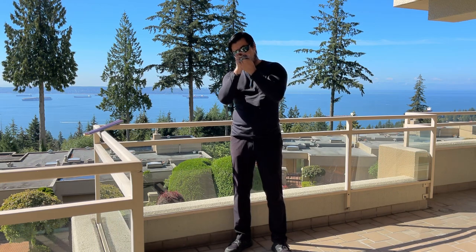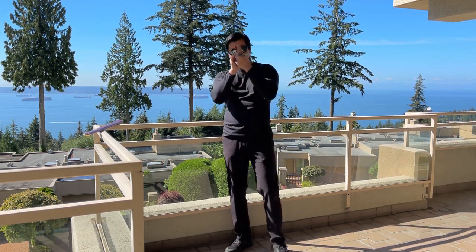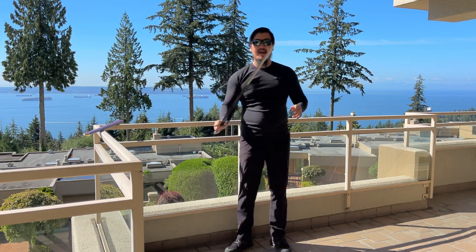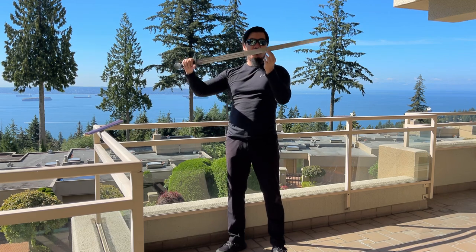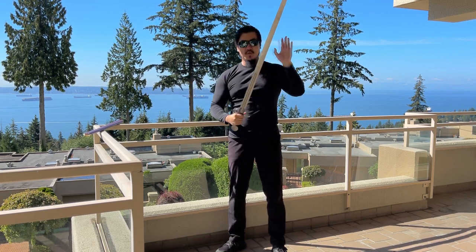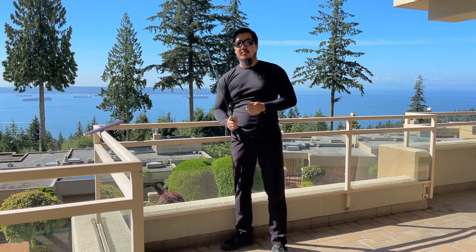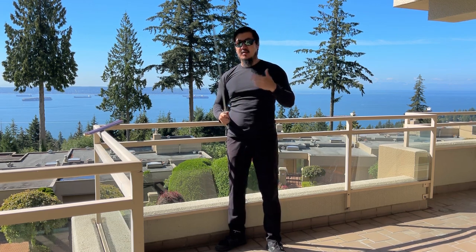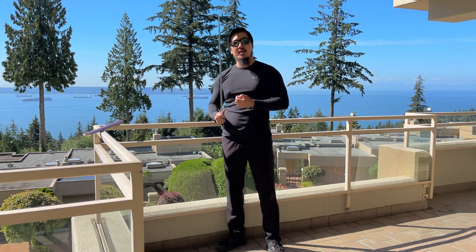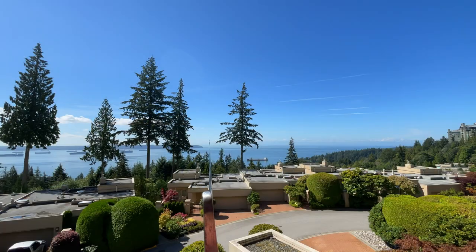The blade is completely flat and symmetrical, executes the unique cross-section perfectly, has a strong handmade feel with some minor ripplings, and it's well polished with a satin finish. It has a singular edge bevel from the hexagonal cross-section to the edge. No secondary bevel. Very refined edge, shaving sharp. So it really fits its aim to cut through infantry with textile armor. You really need very sharp swords with excellent edge geometry to cut through the fabric and still damage the flesh and bone underneath. And both edges are perfectly straight.